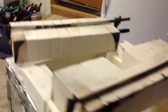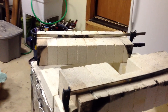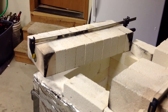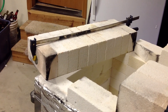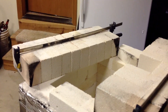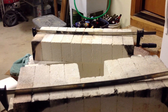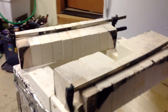The lid is just composed of these bricks held together with pipe clamps. It's sort of a temporary permanent thing. They do a pretty good job and it's nice because the bricks don't get ruined — if I want to unclamp them and reuse the bricks I can. I don't have to drill a hole through them and make a permanent lid system, so this is pretty versatile. The disadvantage right now is these clamps are just a little bit too long to get through the door, so I can't roll it out with the lid on.